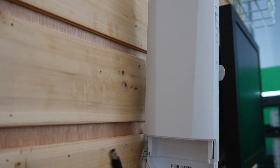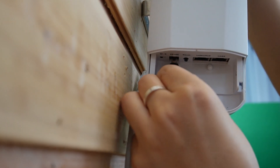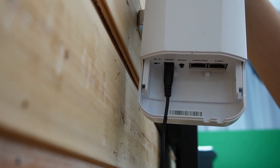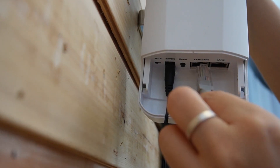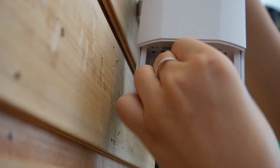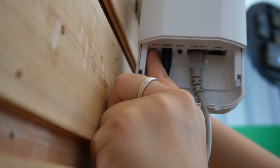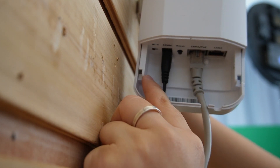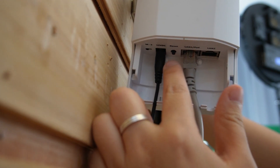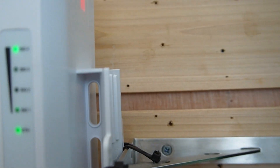First I'm going to power it up — plug in our 12-volt DC. This is the ethernet cable from the router, so now we can have data to transmit through this wireless bridge. Make sure you turn it to the M mode. This is the reset button — we are going to hit this button to configure the channel so they will match both bridges.